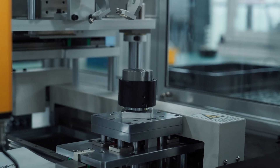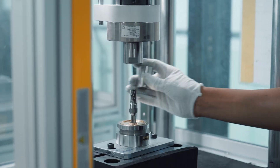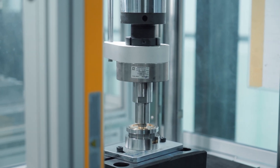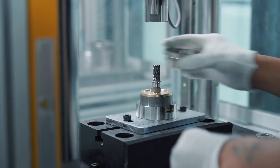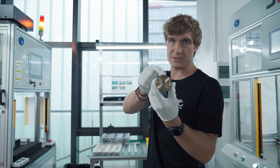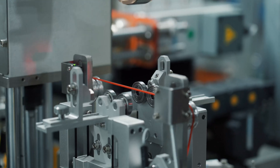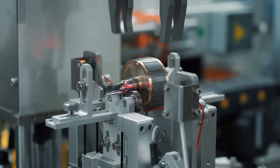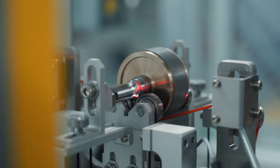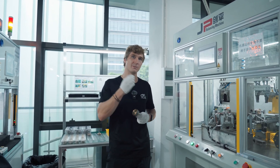After the rotor is made, the gear shaft is installed. Two brass pieces — front and back — along with the motor shaft are stacked and pressed into the assembly. The brass pieces include small drilled holes for balancing. The fully assembled rotor goes into a balancing machine that rotates it, uses lasers and a specific mark on the rotor to analyze rotation, and then drills holes in specific places to balance the rotor. This balancing process significantly reduces noise and vibration, ensuring the motor runs smoothly.